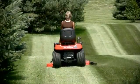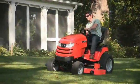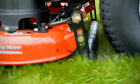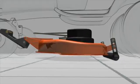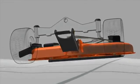Unlike other mowers with their frame-hung decks, Simplicity's free-floating mower deck is mounted on a pivoting front axle so it can respond to the lawn independently from the frame. The deck rides on full-width rollers that precisely track the contours of the lawn. So as the pivoting axle and the rollers move, so does the mower deck — side to side and front to back — for a perfect cut with no scalping or unevenness.